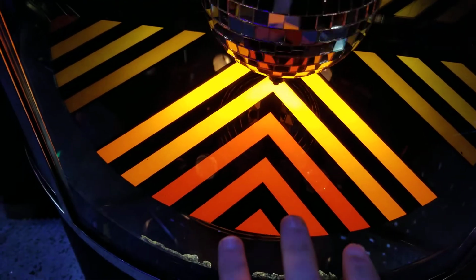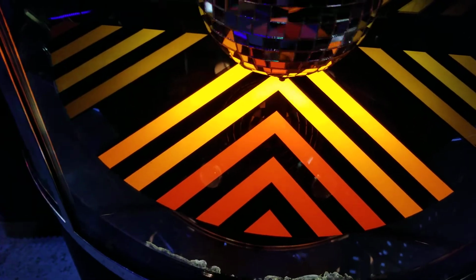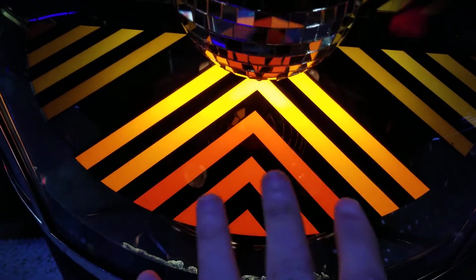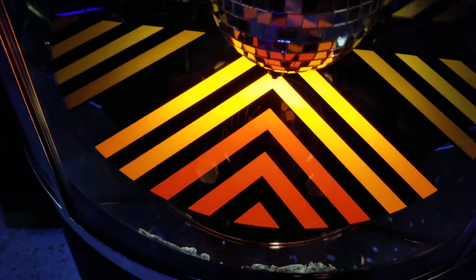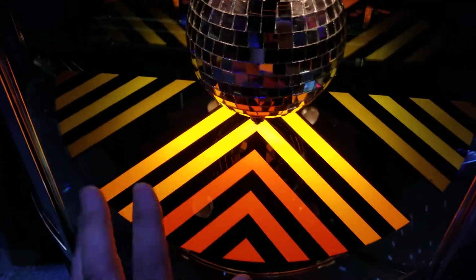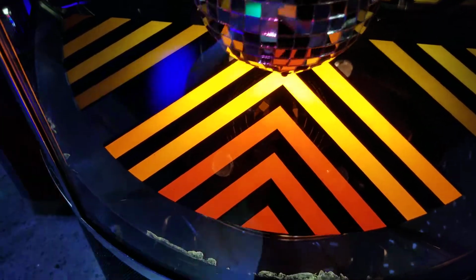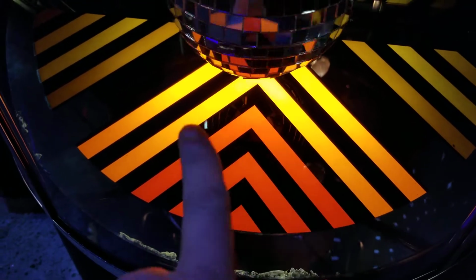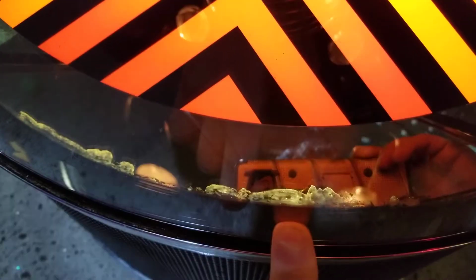There's also something that happens to all of them. There's a mirror effect, and you've got this art on there, put together the same way a pinball machine back glass is. If you've ever seen a pinball back glass from the 70s start peeling, regrettably that happens to most of these. One that came through here was so bad it was unsavable. The peeling had peeled off the art up here where the orange and the yellow was, and there wasn't much that could be done. So this one, I've touched up with some silver paint to keep the peeling from spreading.